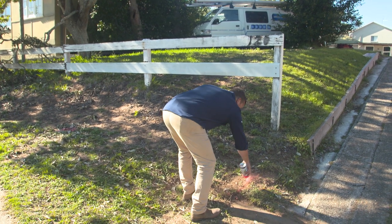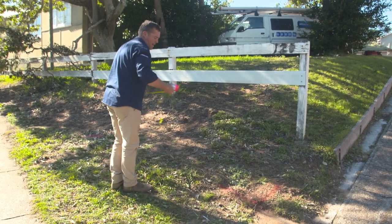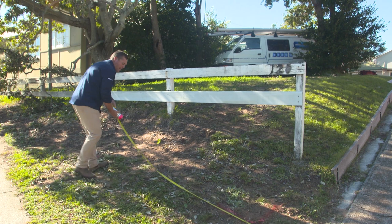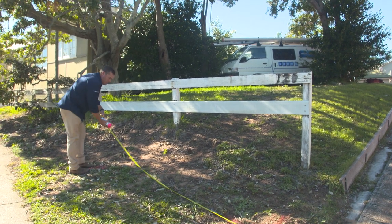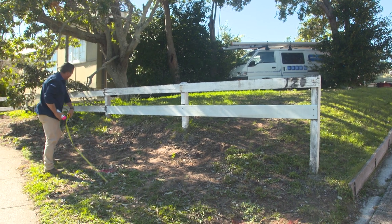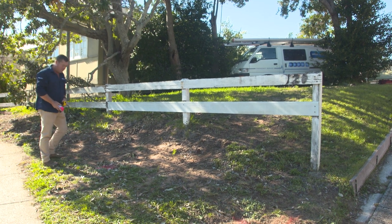If I work off that 90 degrees, I'll go back that way and 90 degrees this way. I'm going to do about three meters dead straight, so I'll mark that point out. I can join the dots later. And then I'm going to curve it back to that post there because with the dry stack walls you can put curves in.